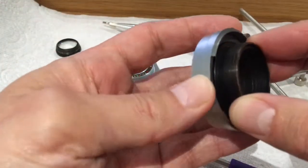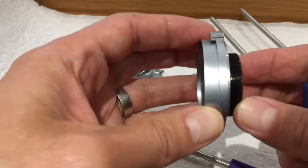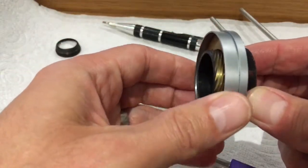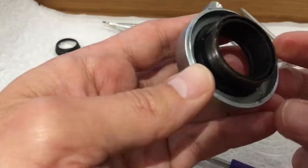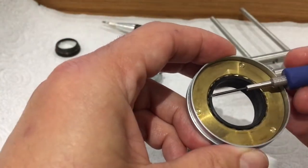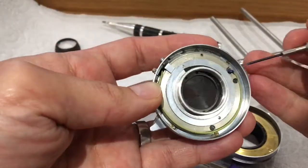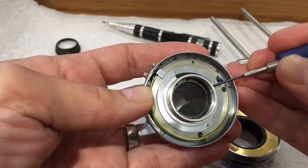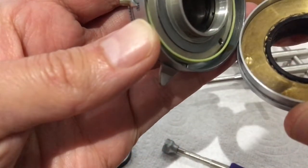There were no shims present. There were sliding screws so the focus helicoid moves back and forth. There is a little hole just there which locates with a very small screw on the back of the shutter, so the alignment of those two is very much fixed.